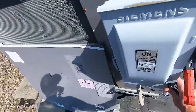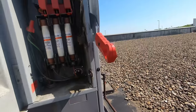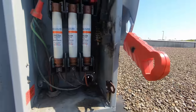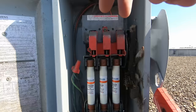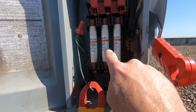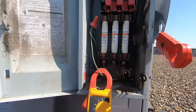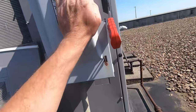So I'm gonna have some blown fuses. 25 amp fuses - we'll go ahead and test those. I'm gonna make sure we have power coming into the top of the disconnect. These two are blown. I do have 460 between all three legs coming into the top. Let's start finding out why - what blew the fuses.